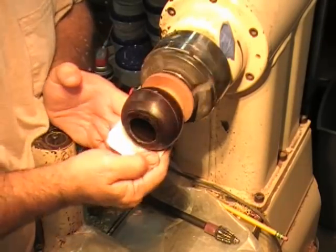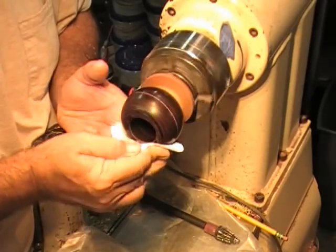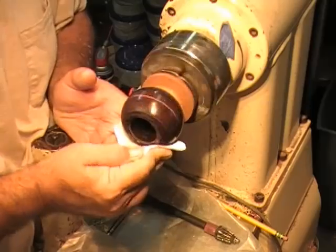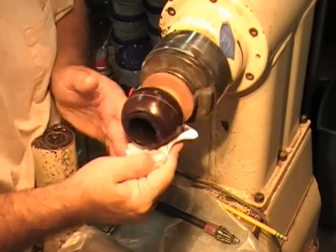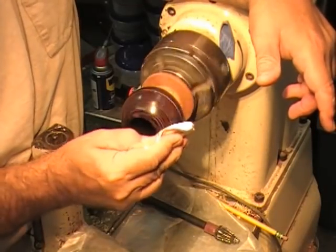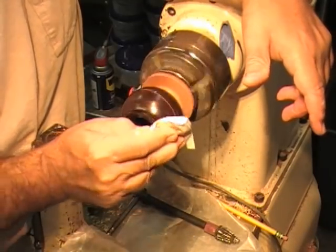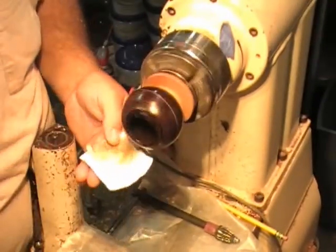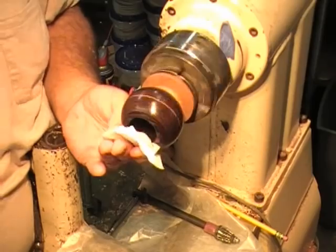The drawback to this finish is after you get a certain degree built up, you have to let it cure off a little while — maybe half an hour, 45 minutes. It'll congeal and tighten up a little bit. Then you come back and add some more. You always have to consider that shellac can go under any finish and shellac can go over any finish — reasonable finishes. It is also food safe after a while — I'd say two or three days, it'll burn off the alcohol and be food safe, just like most commercial finishes.